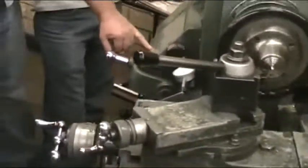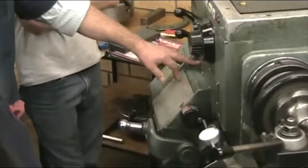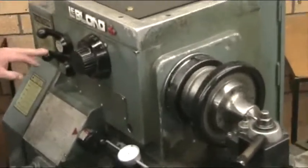All right. And then what do we have to do? So we got the column lined up. Now we need to get the rows lined up. So this needs to be an A and an F. F is up here. It has to be an F anytime it's over 300 RPM. So 99% of the time, we're going to be an F over here anyway.